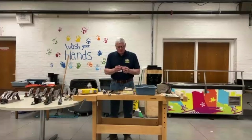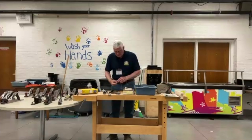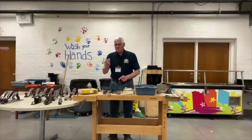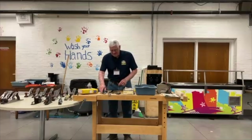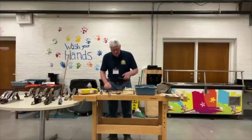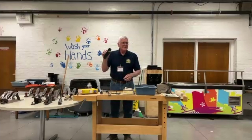Then I take a pair of long nose pliers and this is brass, and it'll shine the brass up like brand new on that wheel. And that's what I do. And I take every one of these parts, long nose pair of pliers, washers, screws, everything goes through the grinder to get all the old rust off. You can't very well use a grinder on this. You can't get in here to get the rust out if there's rust there. And on here, very difficult to clean this up with the grinder. You just can't get in there. So that's where electrolysis comes in.